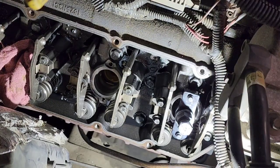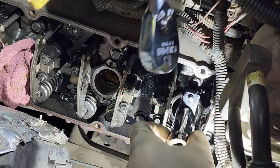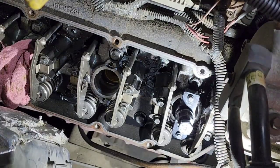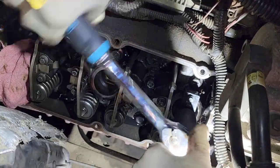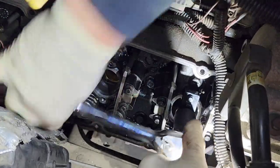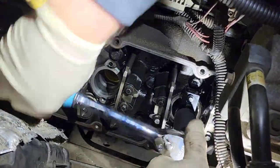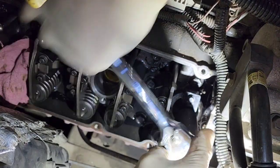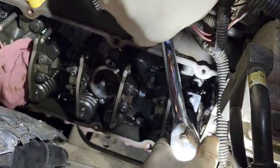Hopefully this works. Now we're going to use this center nut and tighten that down. Let's try a 22mm — my 7/8 isn't deep enough. So now you're going to tighten this center nut down, and what it's doing is pulling the cup out of the head. Once you feel it get loose, one of two things happened: it pulled the cup, or it released itself and let go because you didn't have enough teeth into the sleeve.